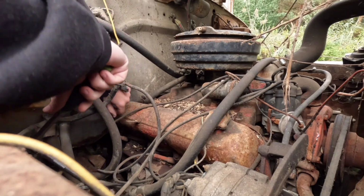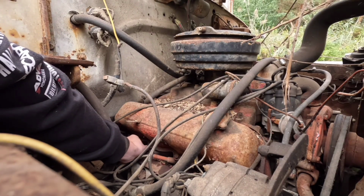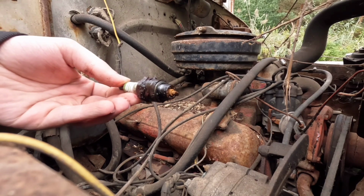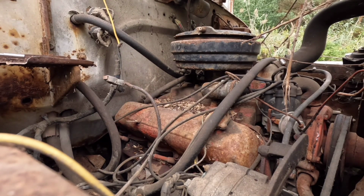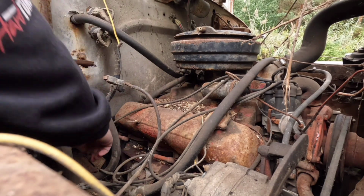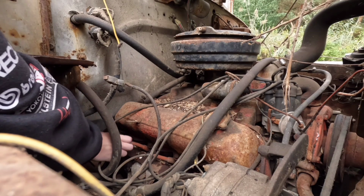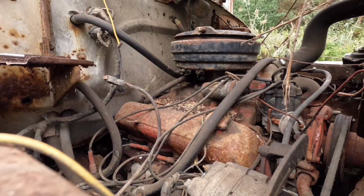Okay, let's see if he'll come out now. Yeah. What's this one look like? Oh, that's bad. That's real bad. That smells like fuel too, so that one was on a compression stroke. Get that one thread in. Set that one back up on there. Pull this one off. And let's get something to pull what's left of the spark plug wire off that one.